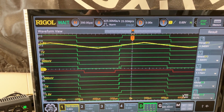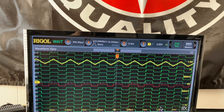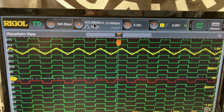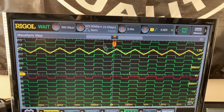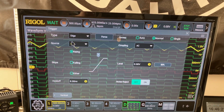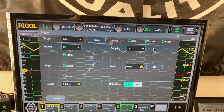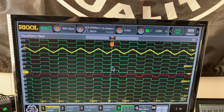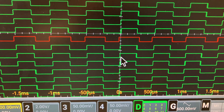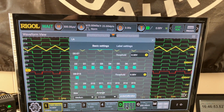Let's move back to some kind of a duty cycle display. I found something interesting regarding the sampling. If you have one analog channel and another analog channel, that gives you the bandwidth equivalent for the logic analyzer. You could use the logic analyzer for the trigger — instead of triggering on channel one, you could trigger on any one of those digital channels. Those are square wave with AC coupling; you could do DC coupling, that doesn't matter. So it triggers on D5 — D5 is stable and you can see jitter on the others.